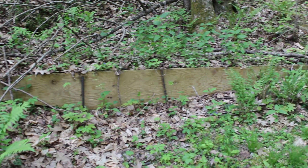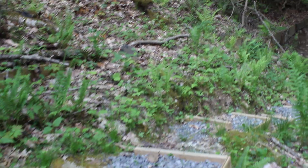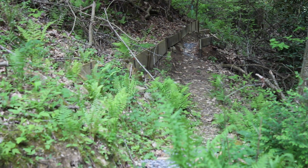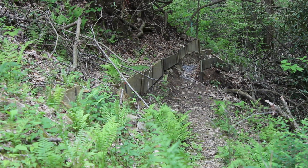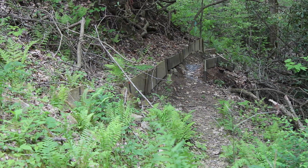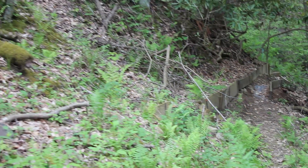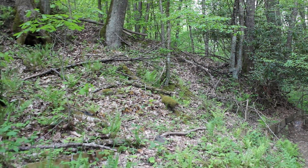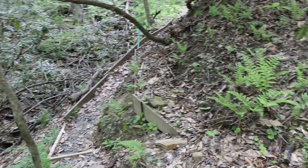It did add probably a few months to the system's total completion time. Now this part of the penstock has a small dip, so I was able to do a retaining wall — just treated plywood and 5/8 rebar to keep the slope nice and even. Then it heads down towards some big tree roots, so I built a long retaining wall there so I didn't disturb too many roots. I would have rather gone up that little hogback ridge, but then I would have had a high spot, and I didn't want that.